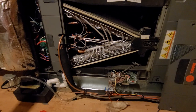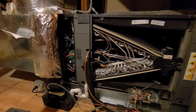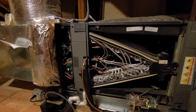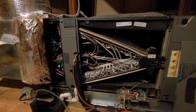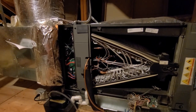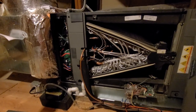What I'm probably going to do is jumper W1 and W2, so when the backup heat does come on I'm getting full heat out of the electric heat portion. Most days it's not a huge deal with typical winter weather, but now that it's colder it's struggling. These people care more about comfort than energy efficiency, so I want to make sure the strip heat is giving them full electric backup when it kicks on.